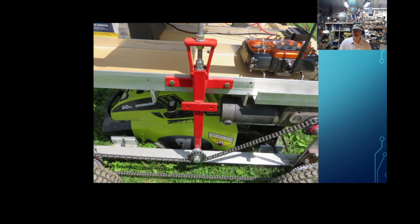So this is actually how I built it. I use these Invacare wheelchair motors I had from a wheelchair teardown a few years ago. They are 24 volt motors, and I'm only running this with a 12 volt system. This is a deep cycle 12 volt AGM battery. I built the frame strong enough and big enough that I can put another battery up here to take it to 12 or 24 volts if I wanted to. My motor controller will handle up to, I think, 40 volts or something on the specs, but that would not have been a problem.